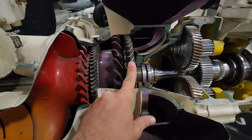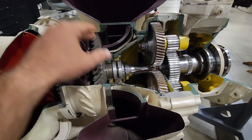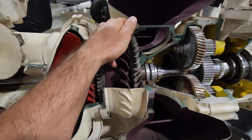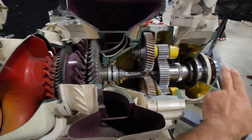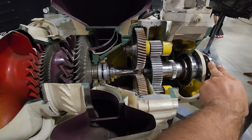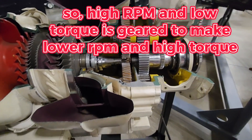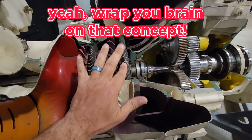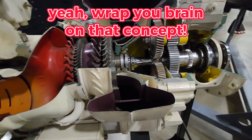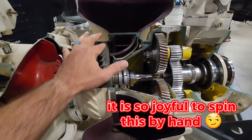This is the N2. The N1 turbine and the N2 turbine — all this N2 turbine does is spin at something like 36,000 RPM and then put out something more usable like 2,500 RPM, which is a typical propeller RPM range of 2,500 to 3,000. That's roughly a 10-to-12-to-1 reduction. The way you get it is: this spins at really fast but low torque.